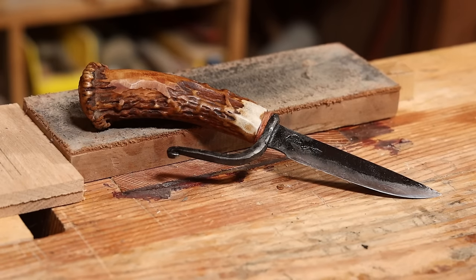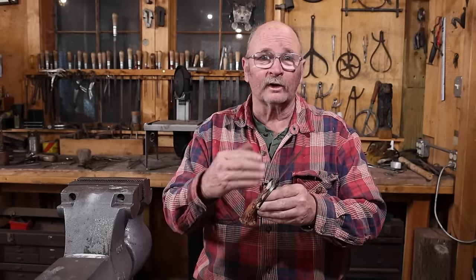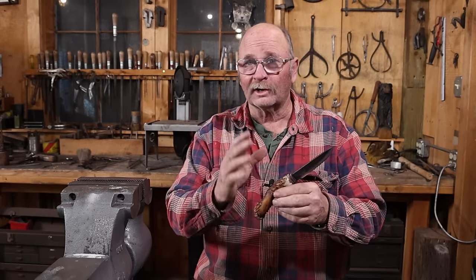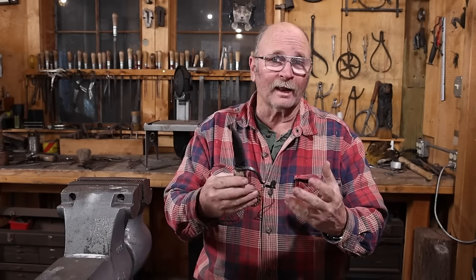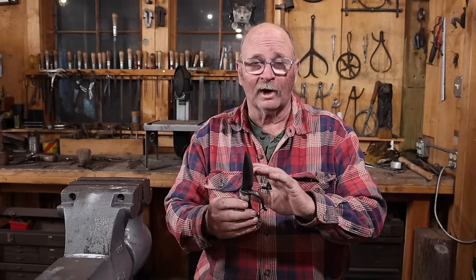Well, that does it for our little knife project — fairly simple project, although I have spread it out over several days. The epoxy I use takes 24 hours to fully cure, so I don't see any reason to stress it by trying to do more work on the knife while waiting for the handle to set. That little hole we put in the back of the handle barely shows — I can find it just because I know where it is, but I'm not sure anybody else would ever notice it. The fit up between the handle and the guard could probably be better, but that's something I like about these rustic knives: they don't need to be perfect and I think some of that stuff adds to the charm and the backwoods character of the knife. I do think I may have over-tempered it — it got a little bit too hot too fast — but instead of holding an edge for weeks on end, it just needs to be sharpened more often, and it will sharpen much easier than if it was a lot harder blade.